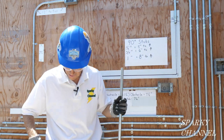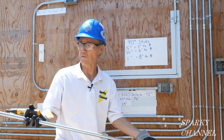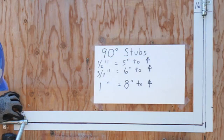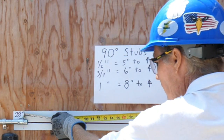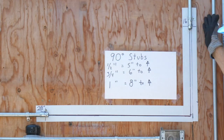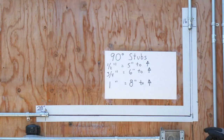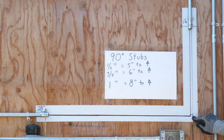We have a nice piece of scrap conduit right here. If this is your job and you can use a piece of scrap, do it. Make sure the ends are real nice. We're going to start from this point right here and measure over. It's 28 to this line, but that's not the measurement we want when we use a star. The star is for the back of a 90-degree bend — the back of this fitting — so you measure over to the back of the bend. That happens to be 28 and 5/16. These are five-eighths of an inch in diameter and half of that is five-sixteenths. So using the star, we measure to the back of the bend: 28 and 5/16.